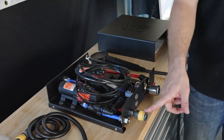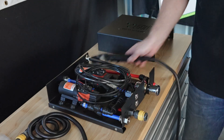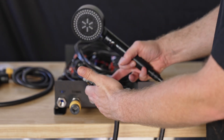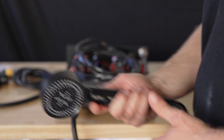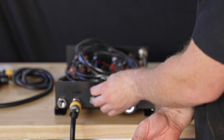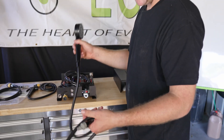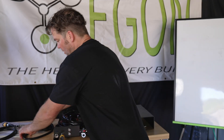The only thing you need to do to connect this to your water hub is to use this connector with a bit of plumber's tape, screw it into the shower outlet. These are self-sealing, so as soon as nothing's connected, no water can flow out. You can store the shower hose in your equipment. When you want to have a shower, all you need to do is turn the switch on, plug the shower hose in, have a shower, and you're done. I highly recommend turning the pump off first, then releasing the pressure, then taking the hose off.